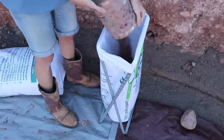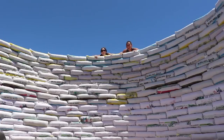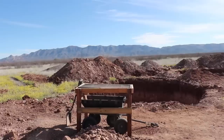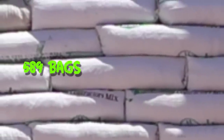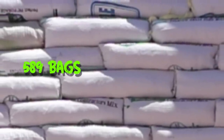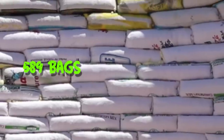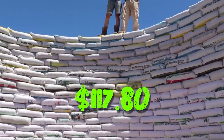After that we built the walls with bags of dirt — that's basically the skeleton of the cistern. Even though the earth bags were a large portion of the material, they weren't the most expensive part, mostly because we filled them with dirt right from our land. We used just under 600 bags — 589 to be exact. The cistern goes five feet deep, three feet above ground, a total of 19 courses of bags. Each bag was 20 cents, so that's a total of $117.80.